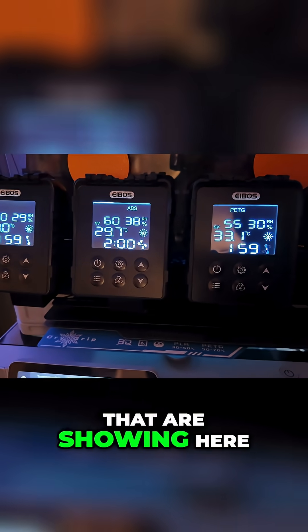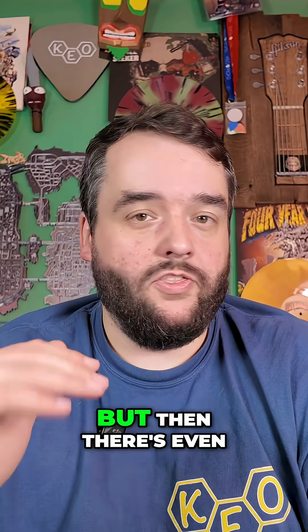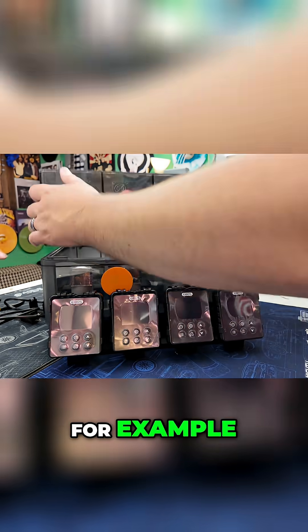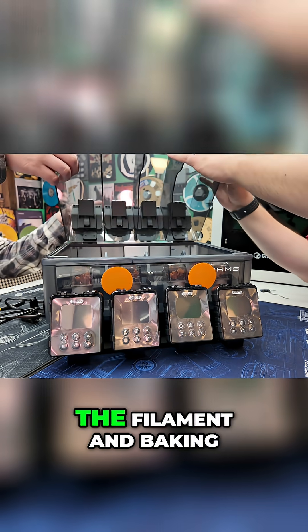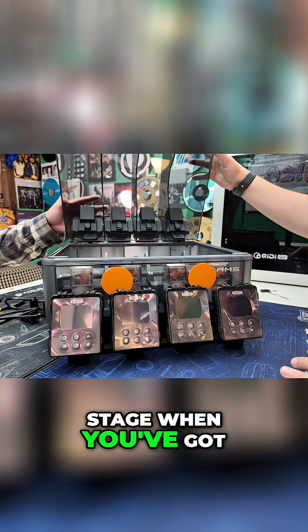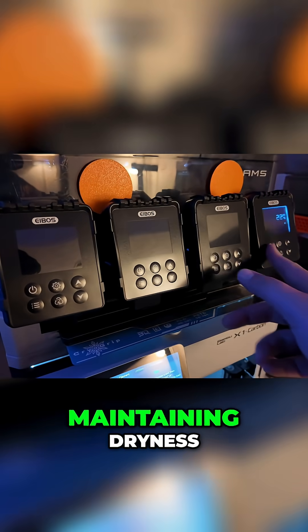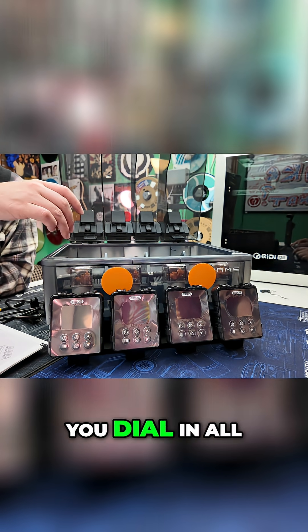Most of these parameters can be adjusted to customize your drying experience, but there's even more layers of super granular control beyond that. For example, there are two stages of drying. The first stage is aimed at actually cooking the filament and baking all the moisture out — that's your initial stage when you've got a wet spool that you need to dry. The second stage is aimed at just maintaining dryness, particularly when you're printing with a spool that's hygroscopic.